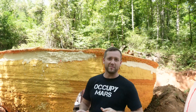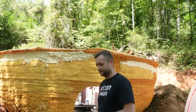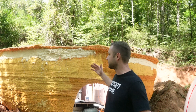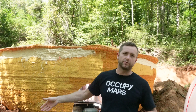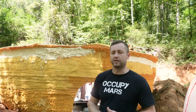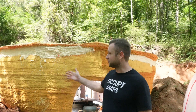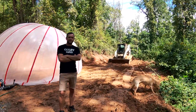It's going to look a lot better when it works well. I thought about scrapping the whole thing — I felt really bad about how much material I would be wasting. So I'm going to save the bottom half. What I'm going to do is fiberglass all the way up to the midpoint, shave it down flat, and then attach an air form to the top of it to try out the air form method. I think it'll work, and I'll know pretty quickly — it's not going to be a slow process. By next time, hopefully this thing will be buried and the top half will be on.